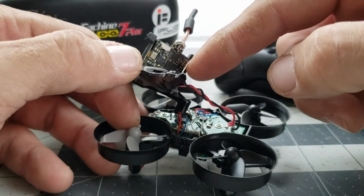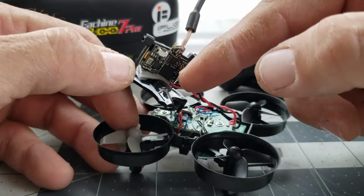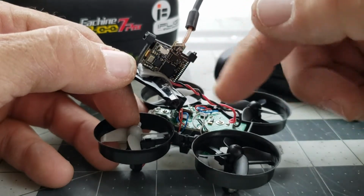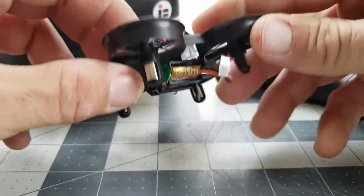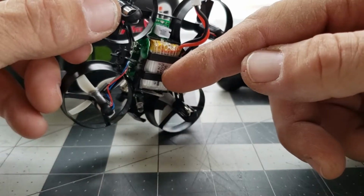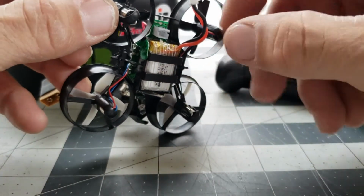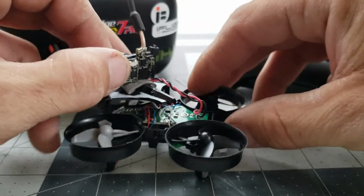Now, you have to pay attention if you go ahead and do this project. When you buy one of these cameras, make sure that the voltage is like 3 to 6 volts, and you can't use any more. It has to be the same voltage that's running off of these batteries. And this is a 1-cell battery, so it's usually around 3.7 volts at mid-range. Your high charge will be like 4.2 volts. So this runs this camera just fine.